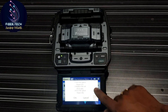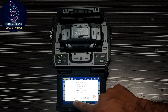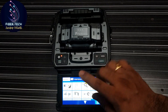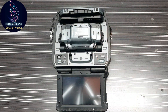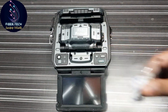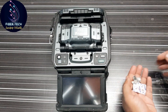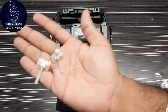First, we have to click on the maintenance tab. Then we have to cancel and reset. We have to stop the splicing machine. Now we have to disconnect the little electrodes — let us open these electrodes and we will replace them. Here we have to replace the electrodes.